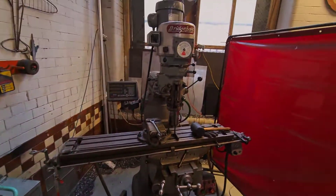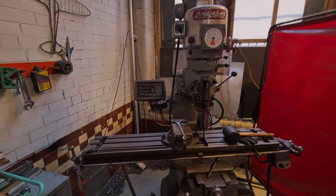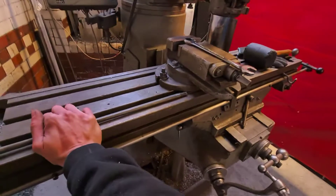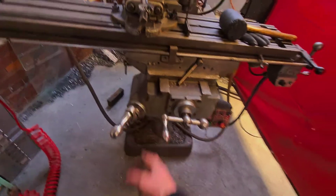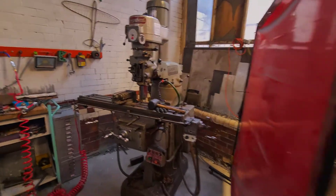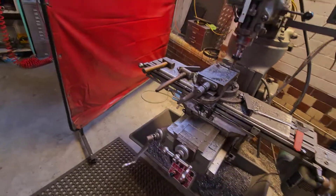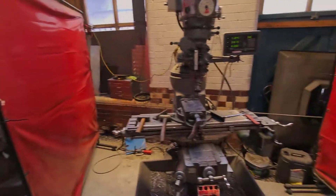And then another Bridgeport that we just acquired — I bought this from the same place that we got the surface grinder from, so we got a pretty good deal because we bought two machines. This does need a little bit of servicing — there is a little bit of play ever so slight in the bed, so we need to adjust the gibs. Might even be able to surface grind them if they need it, then shim them. And then we've got its twin over here — this one has a slightly smaller bed. Made these little guards to stop chips filling in the slots all the time, which is a pain. That one's got the longer table, this one's got the shorter table; both have DROs.